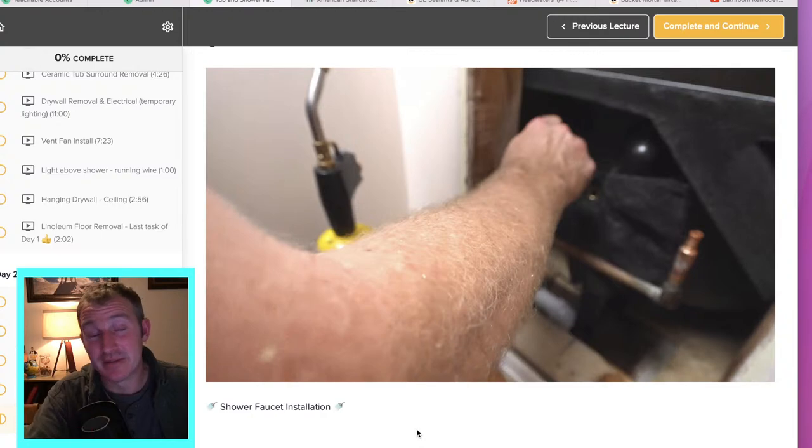This is an access panel to the back of the tub. You could technically use SharkBites on here because you have access to them. If you had some shut-off valves that were SharkBites, you can just slide that right onto the copper, just like the caps that were on there. So you can avoid having to solder anything at all.